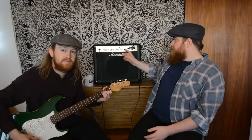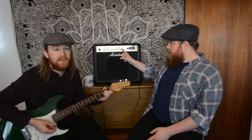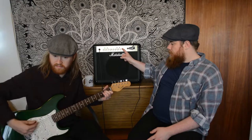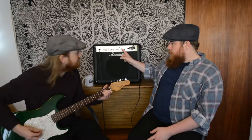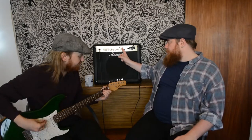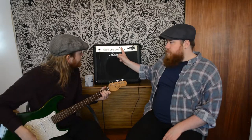The nice thing about what Matt was referring to is that with a solid state amp, when you turn it down, you can't hear anything. And then a little bit louder. It gets louder, but the tone doesn't change. If we did that with a valve amp, particularly my Fender, every single time you turn the volume knob, the sound changes, your tone changes. With a solid state, that is their natural arena, that's how they work. It helps if you turn the volume up.